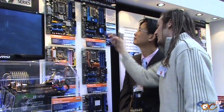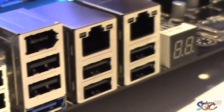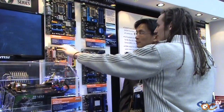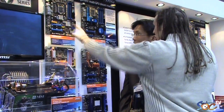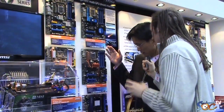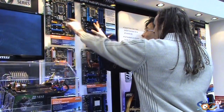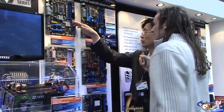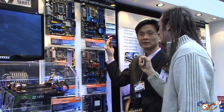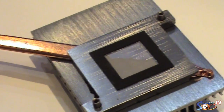As we can see, there are debug ports on the back side — will these be on the final version? Yes, this is the final version. On the P55 board, we have a number display showing phases, but on this one we have debug ports. However, to see how many phases are active during overclocking, this board uses LEDs instead — because this board only has six phases. You can check the phases in use via LEDs on the top side.